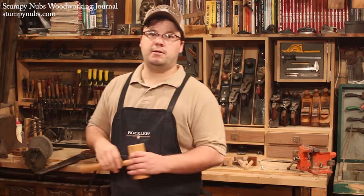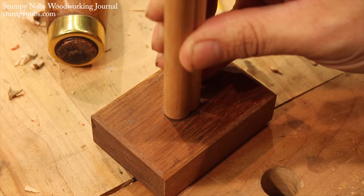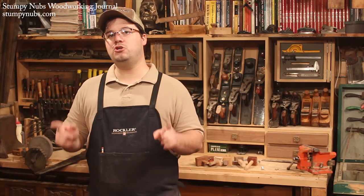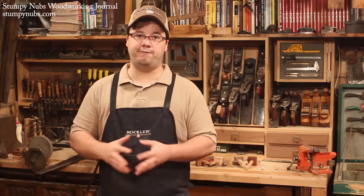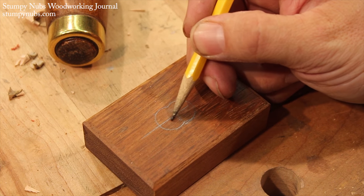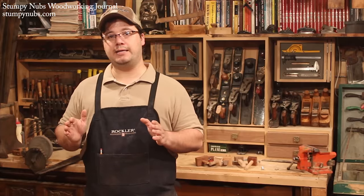The double beam gauge is a little bit different. You'll have to drill two holes side-by-side, which is pretty straightforward, but trickier with the round ones because the position of your holes depends on how much you've planed off the flat surfaces on your half-inch dowels. It's much better to get the holes too close together than too far apart, because you can always plane a little more off the dowels until you get a better fit. What I did is stick my dowels on end right where I wanted the holes and trace around them, intentionally making them a little closer together than they should be. After I bore them out, I can plane down each dowel until I get a nice smooth fit.